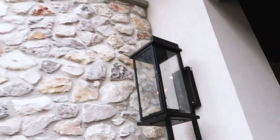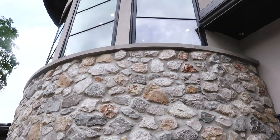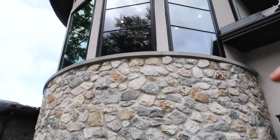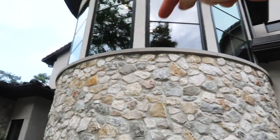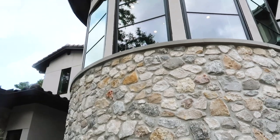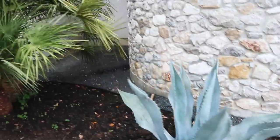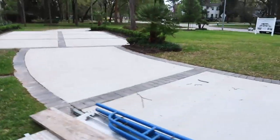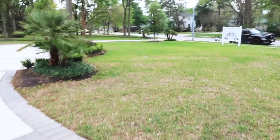You've got gas lamps. Up front we want to double-check that the top bricks are sloped, but they are missing mortar right here at the top. We can look down from outside the office window and see the mortar missing. We have proper weep holes on the stone veneer, but missing weep holes elsewhere — pretty decent finds on the outside.